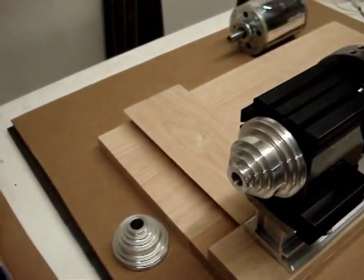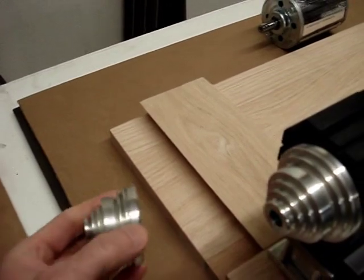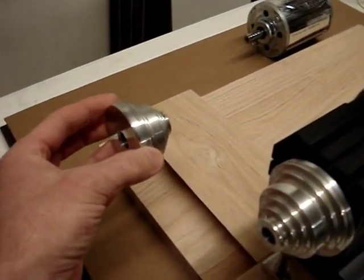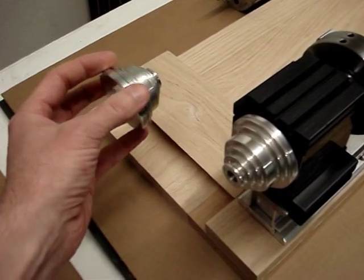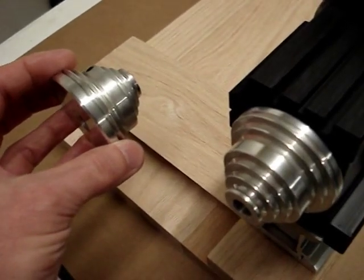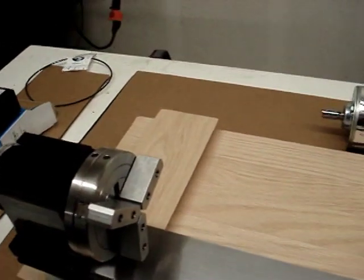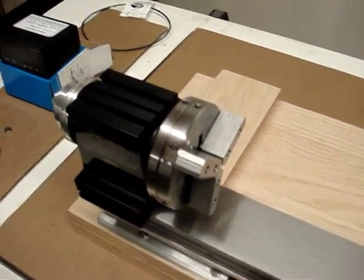Out of the box, they sell it with a quarter-horsepower AC motor. You get a pulley kit that goes on the motor, and they bolt the whole thing down to a wood panel or base. You change the speed by changing the step rate on the pulley — kind of similar to a drill press. The only problem is with an AC motor you plug it in and it spins up to 1,700 RPMs, and every time you need to change the speed you've got to fiddle around with the pulley.